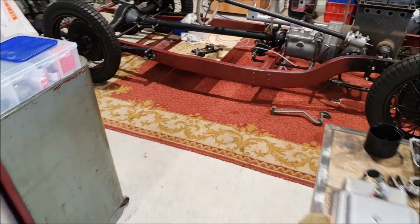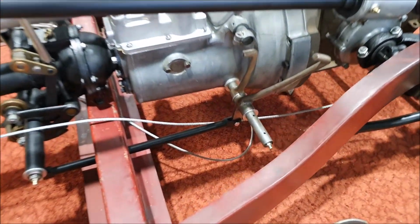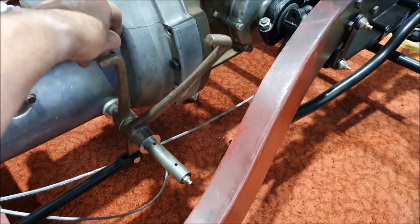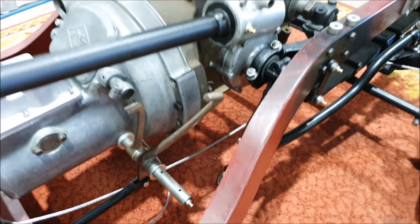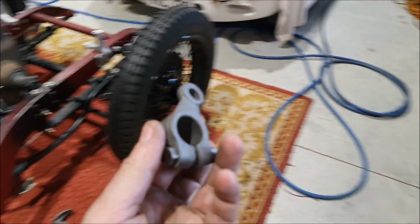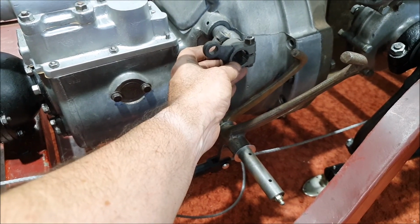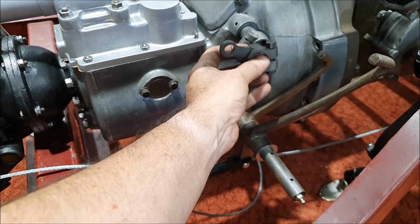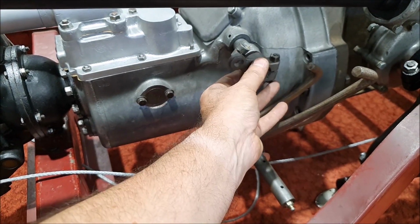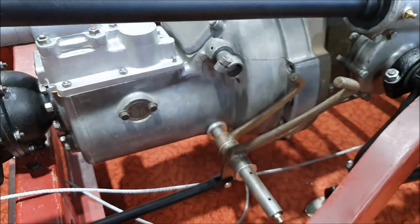I did dig out the clutch pedal. One of the things I need to figure out still is this splined linkage up here. The one I've got is wrong. There's two different sizes. I think I've mentioned this about 27 times already, but that goes on that spline shaft, and that's what the clutch pedal actuates. This one is for a different car where this sticks out a lot further. On this one, the pinch bolt would hit the bell housing.